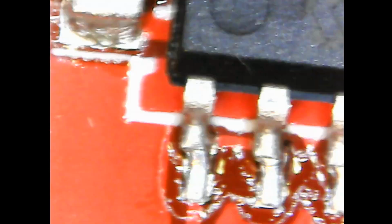That's the problem with glued down parts. They don't self-center, so you have to accurately position them at the start. I'm wondering now if it's better not to glue down the parts, then oven solder to align the part, and then just put a couple dobs of glue on the outside from the body to the PCB. It's certainly possible here because there's not that many parts.